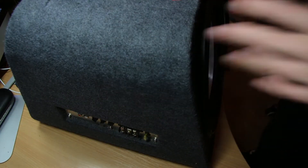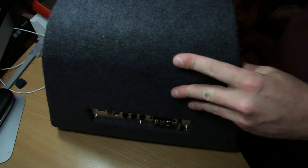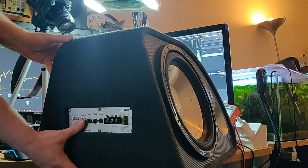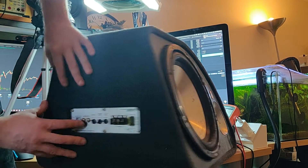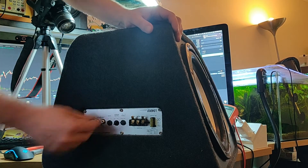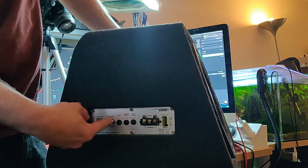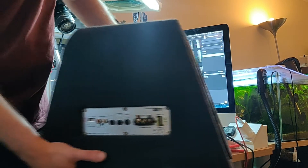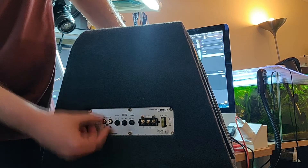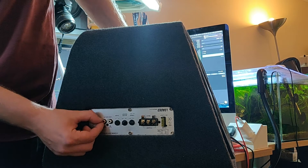What we have here is a subwoofer that doesn't work. It's come out of my old car and it's got a common problem - the connectors here and here are broken. I think what happens is people have them in the boot with cables plugged in, the sub moves around, bangs against something, bends the cables and ultimately damages these connectors, which are in fact loose.